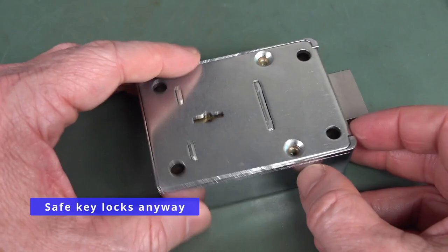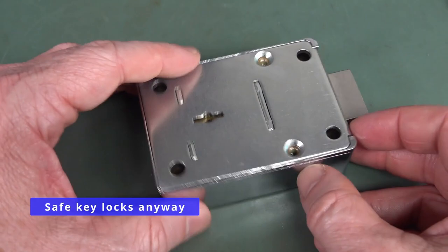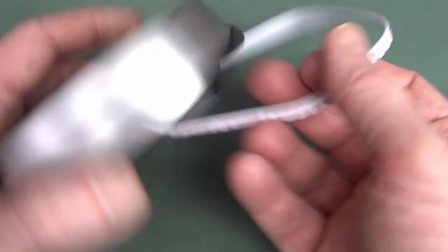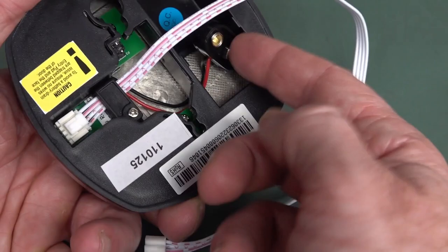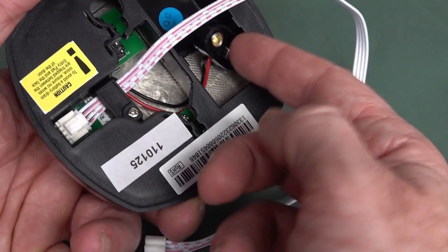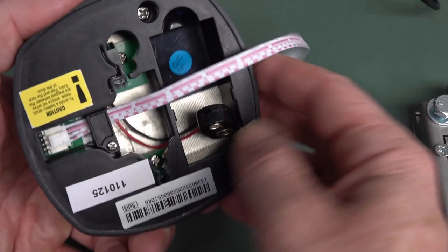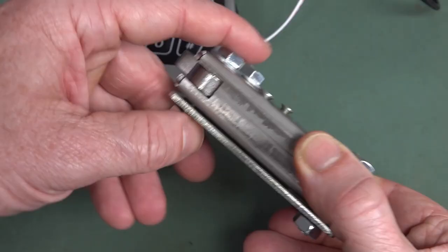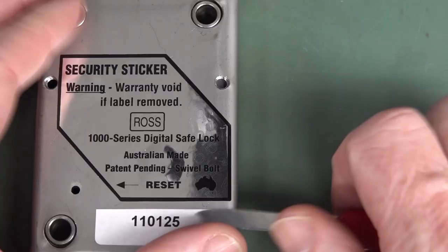Alright, a teardown of the 1000 Series electronic lock. All the interesting stuff is in here because this is where the secure keys are kept - this is just a digital interface. You can smash this off and get access to the wires and everything, but you're still not going to be able to get into this unless there's some side-channel data attack or something like that, or potentially some sort of high-voltage overload. There is apparently one attack method where you can fill them up with conductive liquid and activate the solenoid - not this one I believe, but some brands are susceptible.